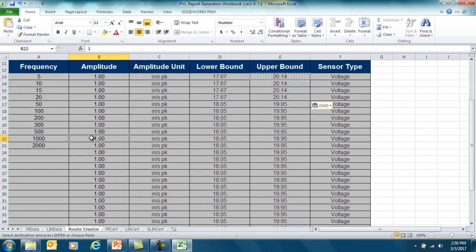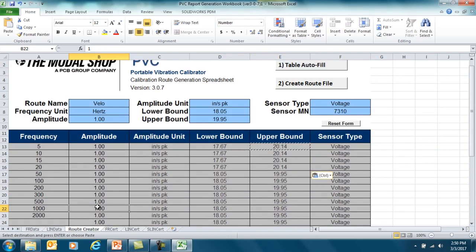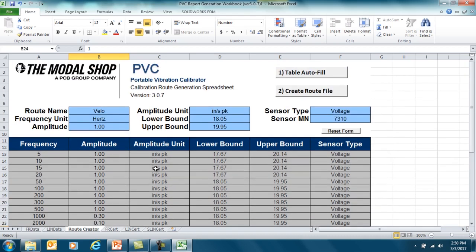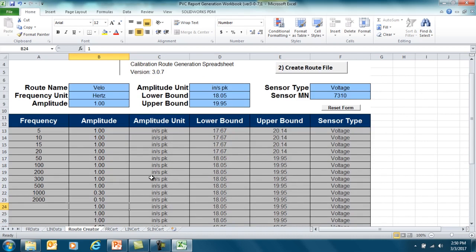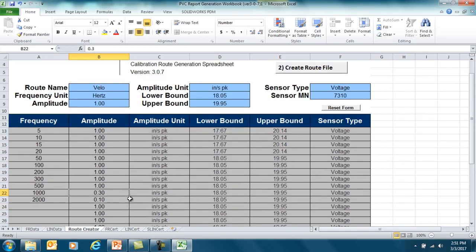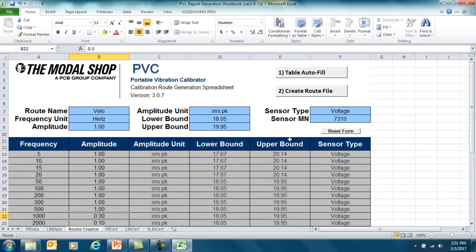The last thing to mention is that at 1000 Hz, we're not going to be able to generate one inch per second peak — we'll be able to get about 0.4 inches per second. I'm going to program these last two points for 0.3 and 0.1 inches per second. You don't have to do this — the shaker won't allow you to program something that will damage itself, and you can still run the test. But for the purpose of this demo, I want to cover that. So we're going to change the amplitude at those two particular test points.